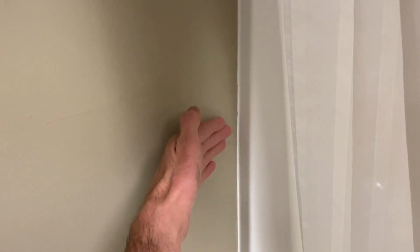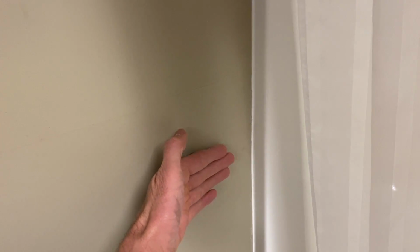So basically there's a flange right here, and normally you can shim out the wall a little bit to help graduate that slope over a longer distance, but when you don't do it, you get a super out of square tile like you have down there. It's kicking out about a half inch.